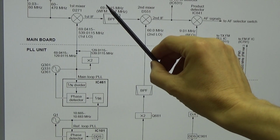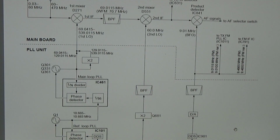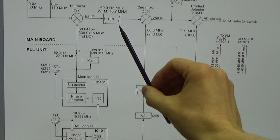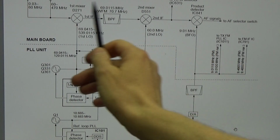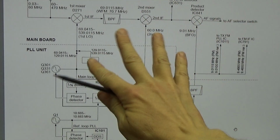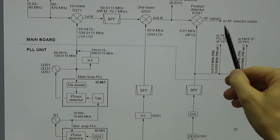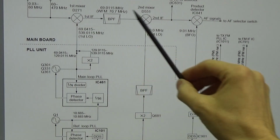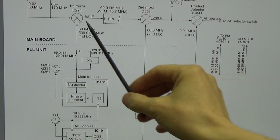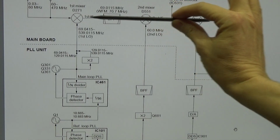And that means we need different LO frequencies simply due to the fact that we always need to create this intermediate frequency, because this intermediate frequency is what we want to use for any further conversions until we finally get back to our audio, because the audio, the speech, or maybe the music for broadcast radios, because every radio is working in the same manner. So our goal is always to win back our audio, and that is why we convert it. And well, I do not want to go too deep into the mixing and why we convert it not only one time but more than one time. So that is the radio theory, why we do that.